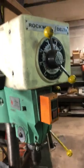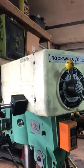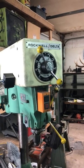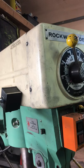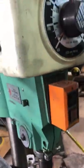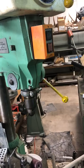This Rockwell drill press is a variable speed that I bought for $40 — it's pretty noisy. It needs work on the belt and pulleys. It's got a Reeves drive in it — a similar variable drive that's on the Polaris belt drive, where one pulley, the faster you go, the more the spring will fly out and let the belt drop into the bottom of the pulley. You adjust the handle here and that drives the spindle pulley up and lets the belt ride further into it to speed it up.